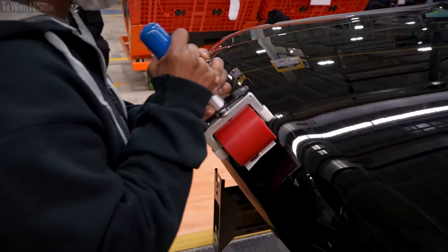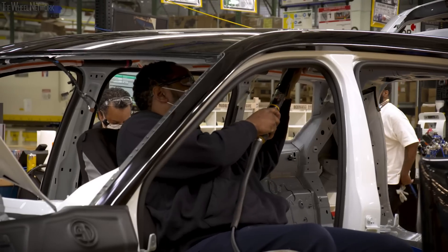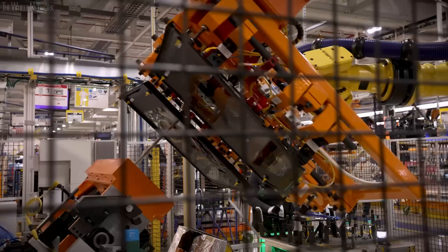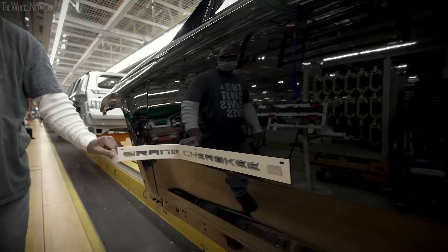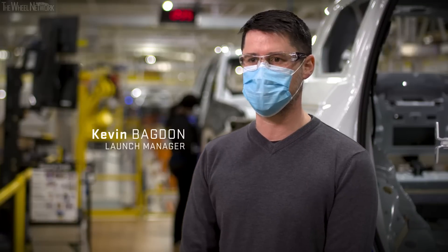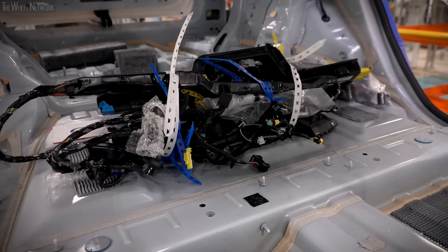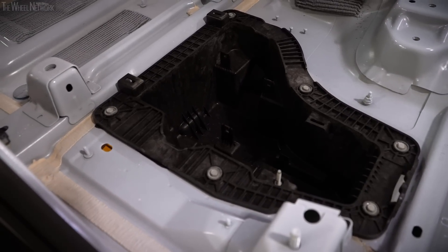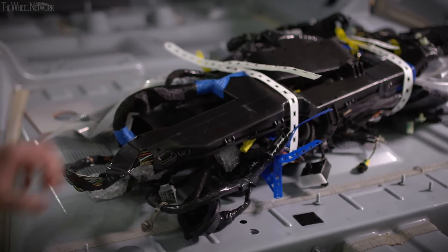General Assembly is broken out into trim, chassis, and final. In trim, the key components are your sunroof install, wiring harness, instrument panel install, quarter glass, windshield, and back glass. We're currently in General Assembly Trim 1 — the first automation cell inside General Assembly. Within this station, they're installing an auxiliary battery for some of the autonomous features. That battery is installed in the tub being placed by this robot, and operators are secondary securing it due to the trail-rated features on the car.